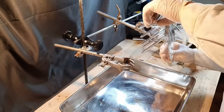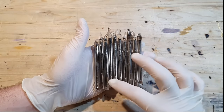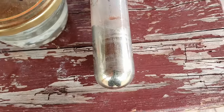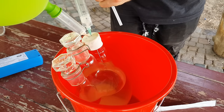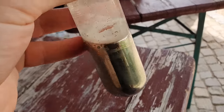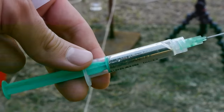Advanced Tinkering prepared ten cesium ampoules at once in one of his videos as a preparation for this video. But since these ampoules contain at least 2 grams of cesium each and we didn't want to start with such a large amount for safety reasons, he also distilled over 50 grams of cesium metal into a Schlenk flask so we can take out much smaller amounts from there. In order not to bother with an argon cylinder, I also prepared some water and oxygen-free kerosene that we added to the Schlenk flask. After melting the cesium metal with the power of hand heating, we could conveniently take out small amounts using a syringe. This worked surprisingly well and we were able to handle the cesium metal with only negligible oxidation.